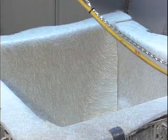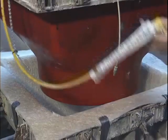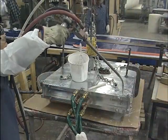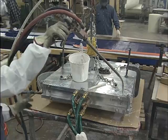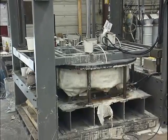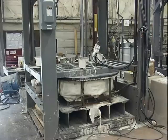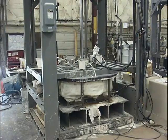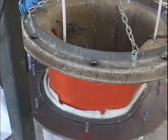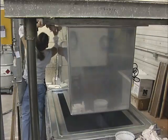Although inexpensive tool material can be used, resin transfer tool cost is high because tool design is critical to achieving resin saturation throughout the part within reasonable time. The mold must allow the resin to reach all areas at similar concentration at about the same time before gelation. The molds may be insulated for temperature control, even if room temperature cured resins are used, to help ensure uniform resin viscosity and gel time. Common resin transfer mold materials include glass fiber reinforced polyester tooling, and molds made of aluminum or steel for high volume production and/or elevated temperature curing.